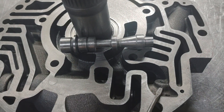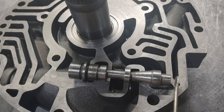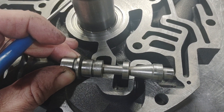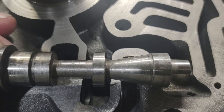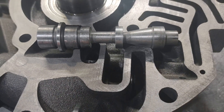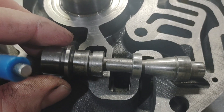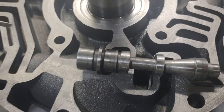There's a spring on this end, and it pushes the regulator against the spring and opens the flow. There's a small orifice hole here that feeds to the top of this valve, and there's a plug that goes in the pump up here and a roll pin that holds the plug in right there. For this thing to regulate pressure, the regulator has to move and crack open right there, which allows the pressure to flow back into the suction side and be recirculated. That's how the pressure regulator works — there are also ways to increase spring pressure and load, like with a boost valve or an adjustable pressure regulator.